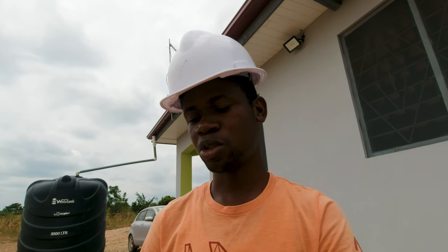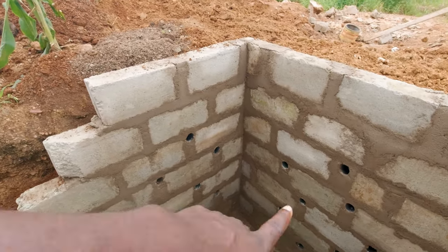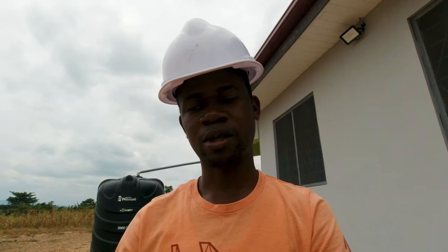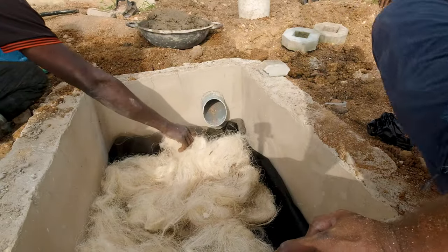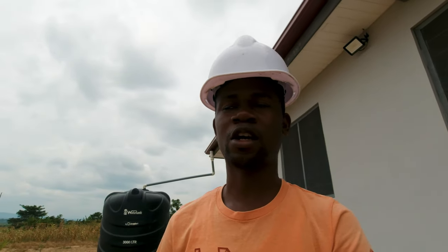We also used eight pieces of 11.5 mm iron rod. Additional materials included two-inch pipes going into the walls or blocks, coated mesh for the biodigester, fiber net, the treated coconut husk fiber itself, and pop fiber — though the pop fiber is not mandatory, that was our choice to include it. For the fiber, we used one sack of it. It's mostly best to get more, but from what we got it was sufficient to do the job.